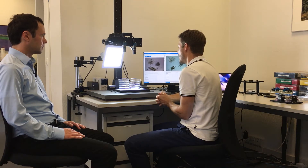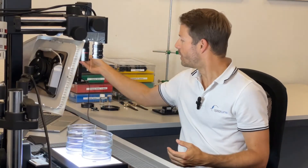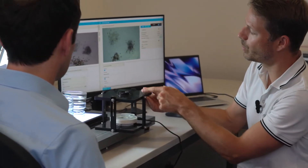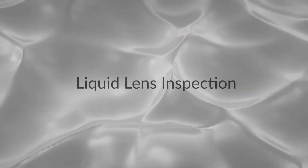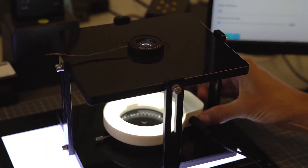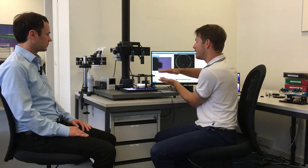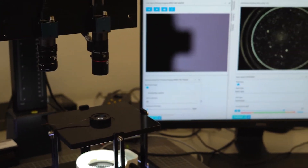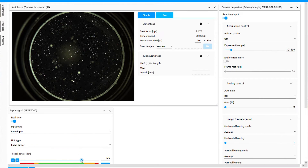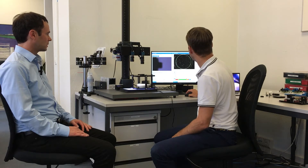That's actually another application we use in-house. We produce liquid lenses that have two cover glasses on the top and bottom, and I have a setup here where we use a liquid lens to determine which layer a particle is on. The liquid lenses have a container glass, liquid membrane, and top cover glass. We inspect for particles using dark field illumination. Because the distance between the glasses is significant, you can't capture everything in one shot. With the liquid lens, I can see small particles on the bottom container glass, then switch focus to the top layer to see different particles.